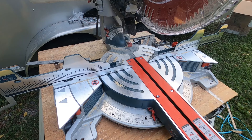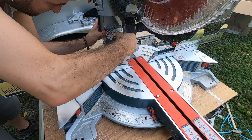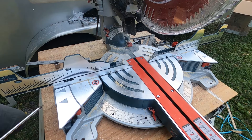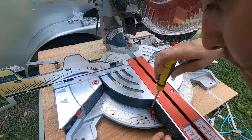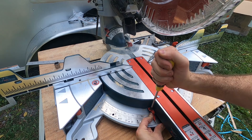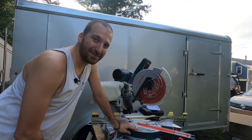I think the last thing left to do is to set the stops right on zero, because we made some adjustments. This is very straightforward — you just loosen it up, put it on zero, tighten it up. It could really use a washer on there because it just wants to move every time you turn the screwdriver, so you kind of have to set it back and as you tighten it will turn onto zero. That's it for the Bosch glide miter saw. If you like this video give me a thumbs up, leave a comment below, there are links in the description for all this stuff, don't forget to subscribe if you like these tool videos, and I'll see you on the next one.